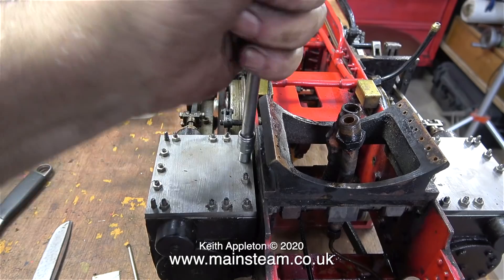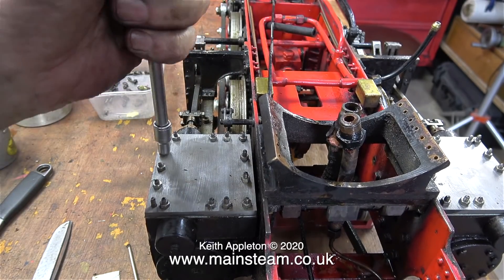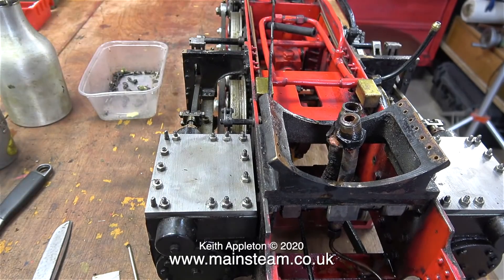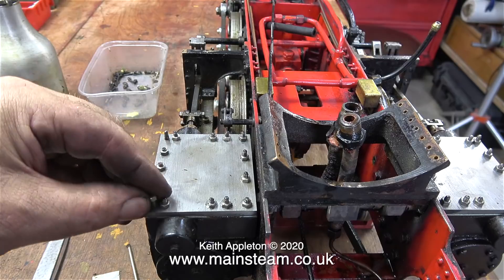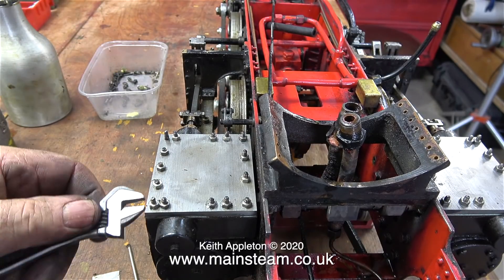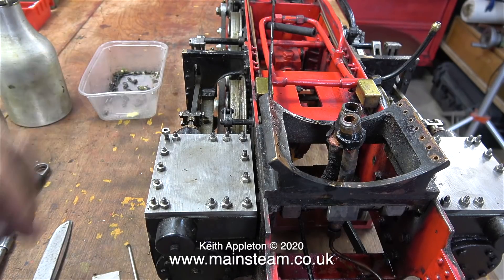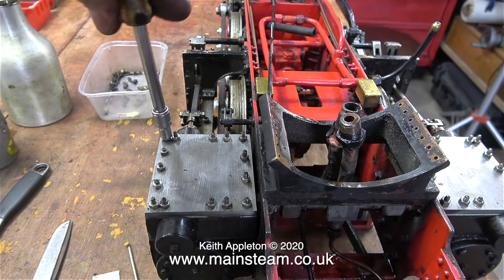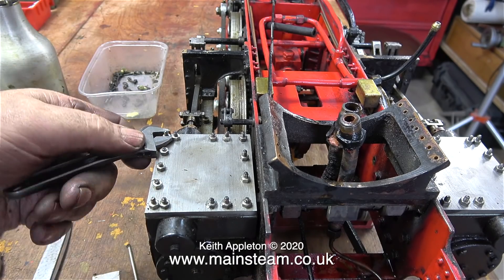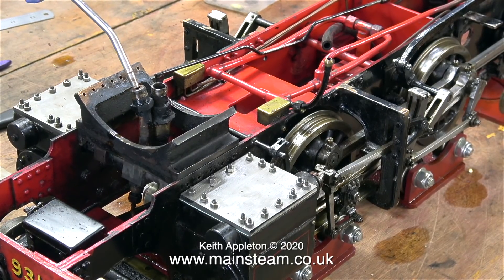When working on miniatures, it's really important to evenly tighten the nuts. But be very careful not to over-tighten these nuts, otherwise you'll just shear off the studs. Fitting the nuts in the corners was slightly different to the rest of them — I could get so far down with the socket, then I had to use a spanner. Now both steam chest covers have been cleaned up, all the old gasket material has been removed, so there shouldn't be any leaks, and the only way to find that out is to apply the airline.